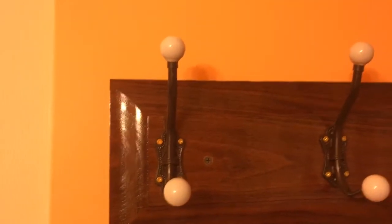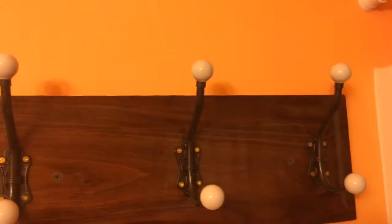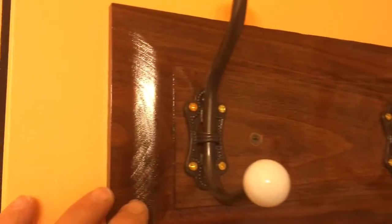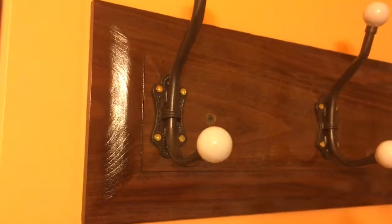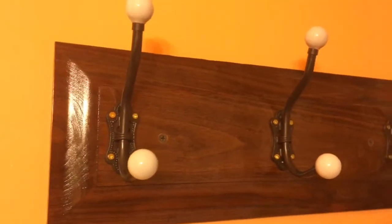Did the same thing in my daughter's bathroom too. More sawmill material over here — I built several of these. I've got several in my own house, but this is a towel rack. It's about 20, 21 inches wide if I remember right. I just used that five-inch diameter raised panel bit that I used for building the raised panel doors, and just kind of bring it down — you can bring it all the way down to zero, or leave a quarter inch or whatever. It just makes a real nice hat rack, coat rack, towel rack — whatever kind of rack you want to call it.